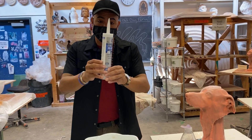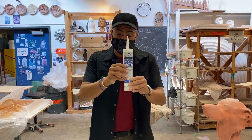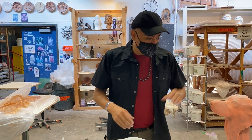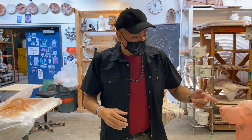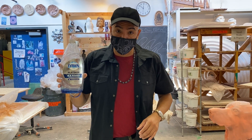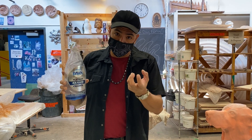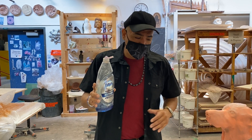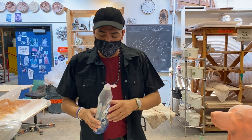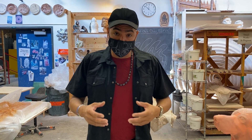We're going to save some money by using Silicone 1 GE clear — that's the silicone you have to buy. That's the best stuff because we're going to do a specific technique to add to that thickness. Instead of using regular silicone and allowing it to dry and get all smelly, we're going to use a simple tactic where we add a base to that silicone acid. That's going to allow it to dry a little bit faster so we can handle it with our hands and apply the silicone like a putty, instead of smearing layer after layer, which could take a lot of time and waste money.